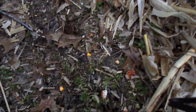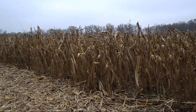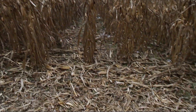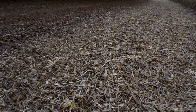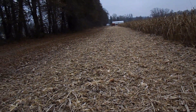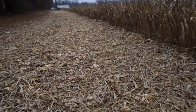This would be about where the tail end is — there's some corn on the ground, and that's to be expected with that much material, 13 feet of material going through it, and it's kind of damp on top. I did this because all these end rows, especially from where I'm standing, really didn't have much corn, and they were those small nubbin ears. As you guys know, small ears especially on older machines get ground up in the corn head — that's why I did this.